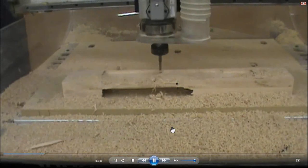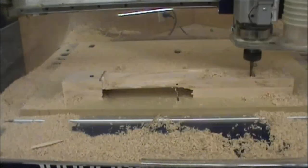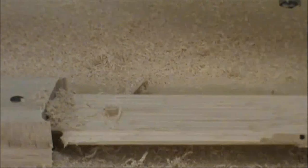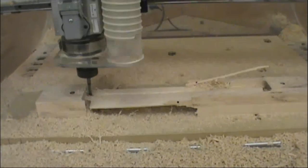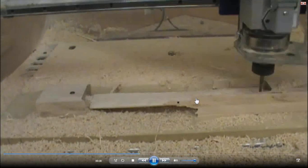That's just preference I have. I realized a wider board works good after cutting this, and I'll show you the big prop at the end once more. So the roughing really is pretty vicious. Look at all the big chunks it takes off. This poplar being real stringy stuff, it just grabbed onto it. And that blowout was pretty bad on the sides.